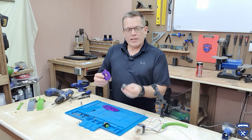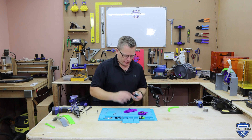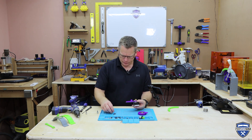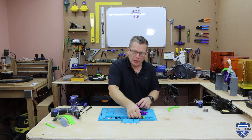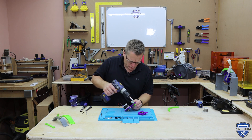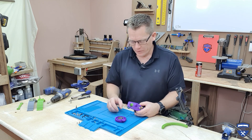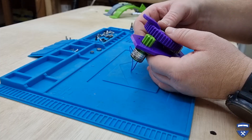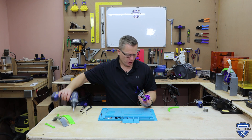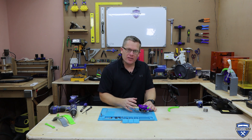This is a brand new part. It takes a 6202 bearing and the idea is that it's going to have to go on last. I need the stepper motor next — putting the stepper motor in. Stepper motor is on. Hall sensor next. Hopefully you can see that I've left the hall sensor loose so we can adjust the gear meshing depth as we require. That leaves the mid-gear drive to go on. I'm going to push the hall sensor against the big gear and then tighten it up.